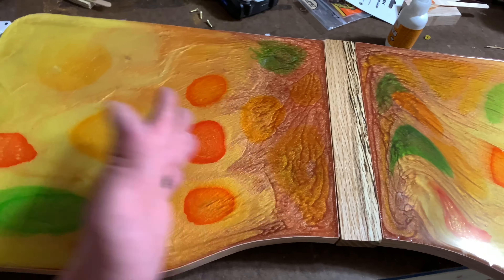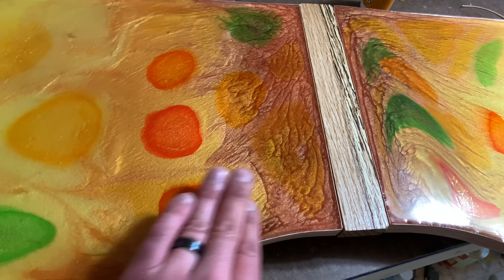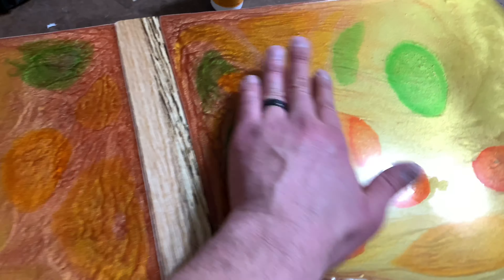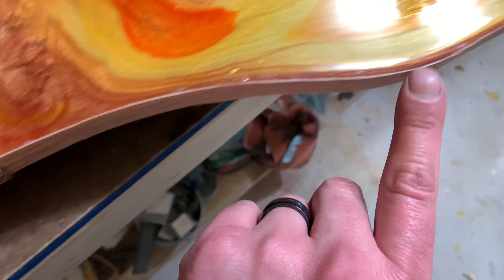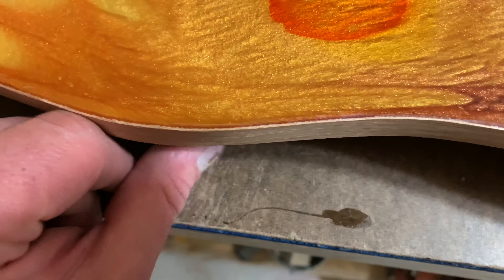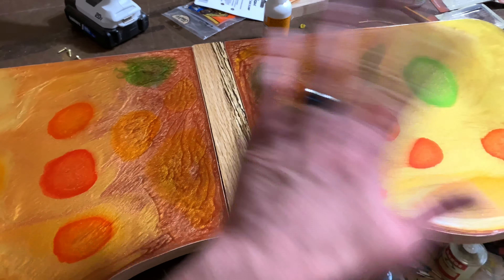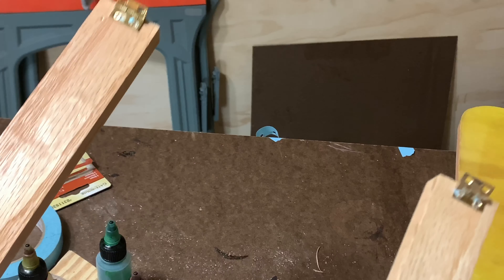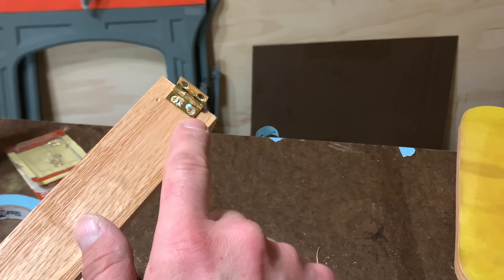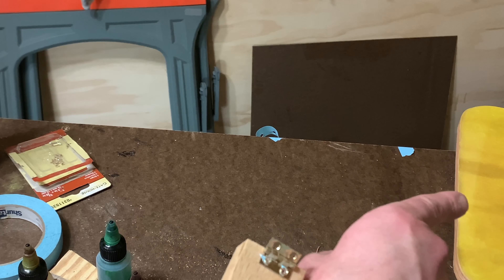Success! It shifted a little but it's all cured. It still needs to sit for probably a couple more hours, but I'm not leaving fingerprints in it. I was able to clean up the edges as best I could with a knife. I've already applied tung oil to the edge banding. We're just going to let this sit a little while longer. We just got to put the legs on the bottom and this is complete. We got all the hinges on the legs — we couldn't get all the tape off but that's okay. Now we just need to attach this to the top, add a little more oil, and we're finished.